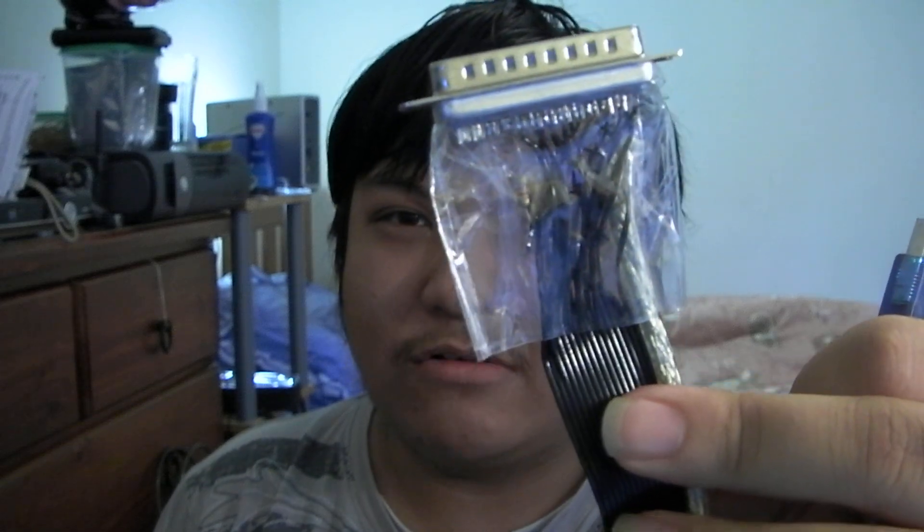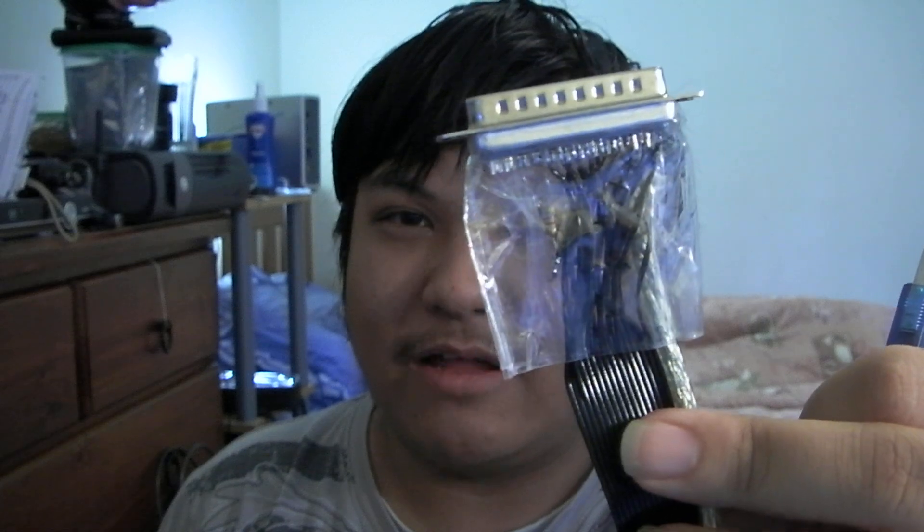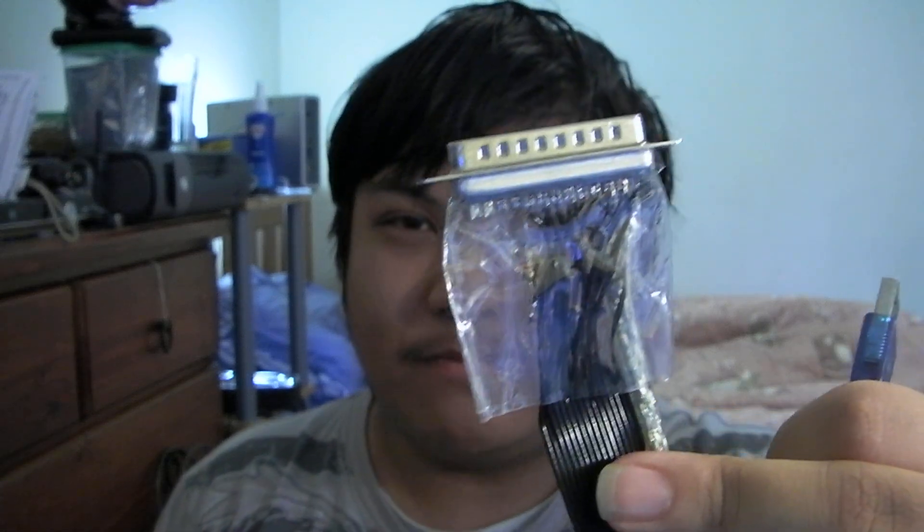Now, in the LCD Smarty documentation you will also need to power your LCD display, and you can't do that through your parallel port. Some people have hacked up a Molex connector inside; I've gone for a much more simple approach and taken my five volts from USB. The other side is just a 16-pin connector for your LCD — you just plug it in and plug it into your parallel port, and you've got yourself a little display.